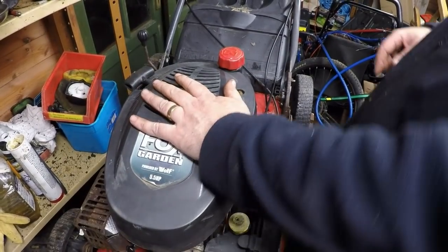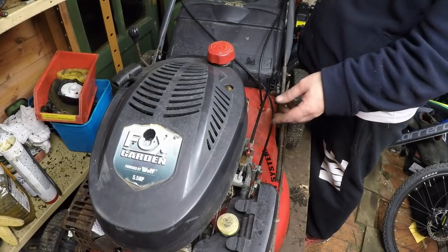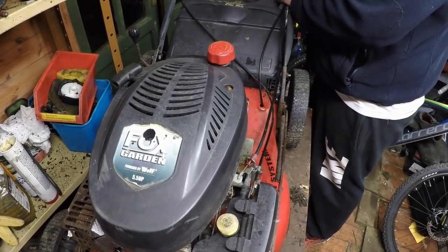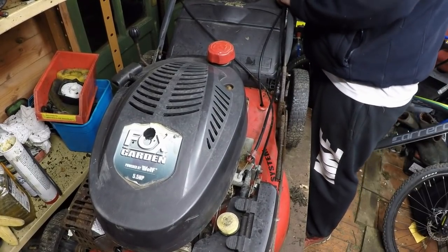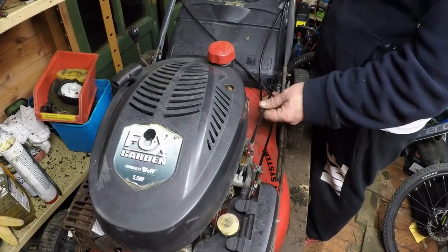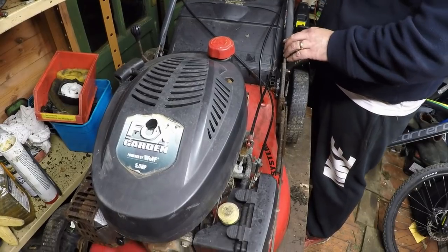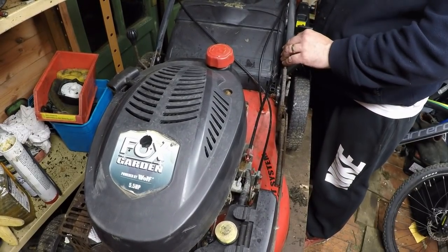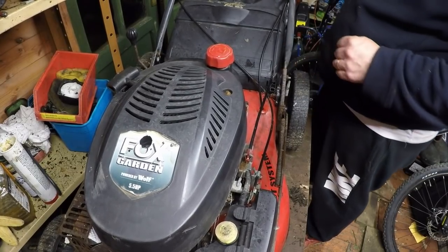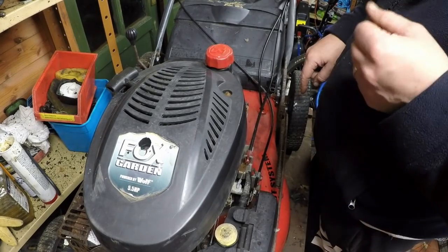So that's all now back on. The cables that are actually shot are just the drive cable. The dead man's handle cable is rusty, but it does actually work — I'm happy with that. However, I've got a feeling it's going to snap at any time, so I don't want to give it too much physic. I may have to look into replacing that one. But the drive cable is shot, so I can't test the drive as of yet. The throttle cable is actually functional, so I can at least test it.